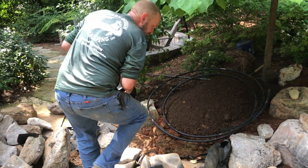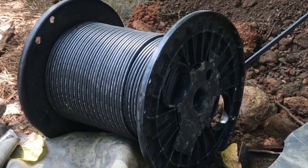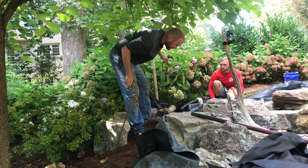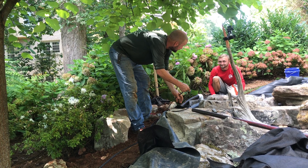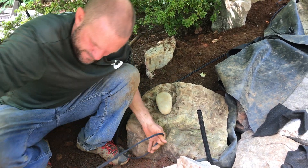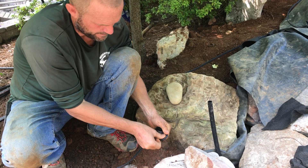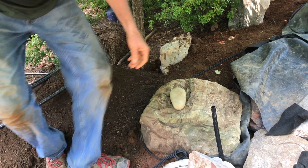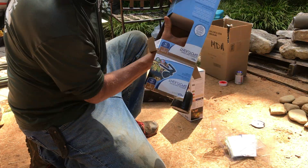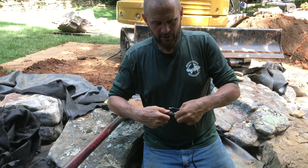We're using LED lights — this is overkill for us, but I like to make sure that if somebody adds a few lights to the system later, it's gonna work. Every time we come to one of these conduits, I run the line and leave a loop for every conduit. That way, when I come back later, I can make a cut and make a connection to the lighting wire that comes out. This is a three-watt Aquascape light. Most people use the little three-plug or six-plug splitters — here's my take on that.